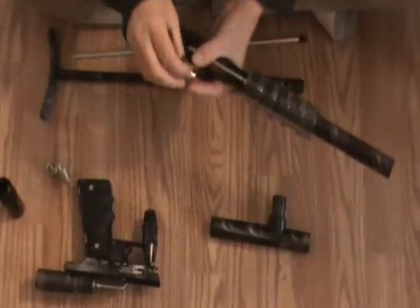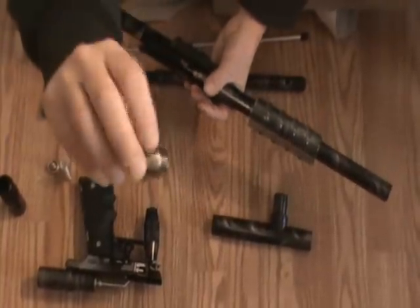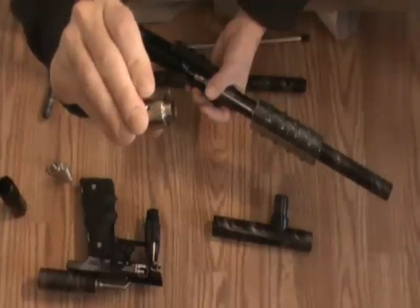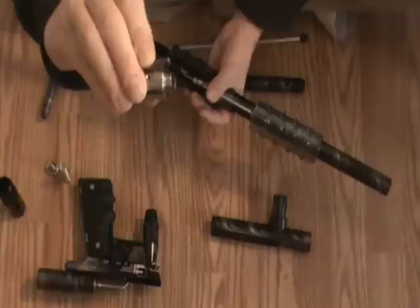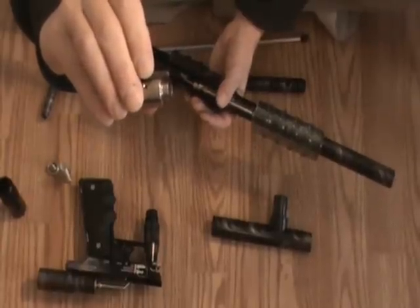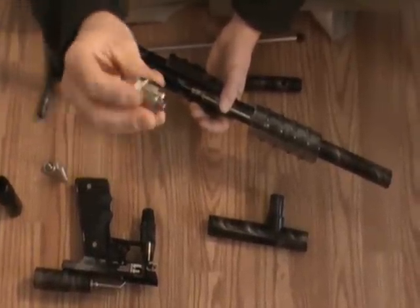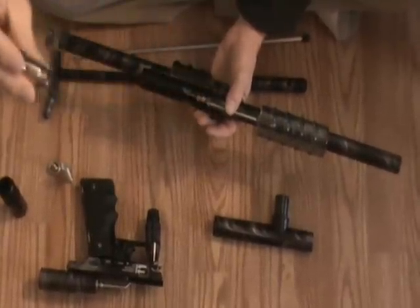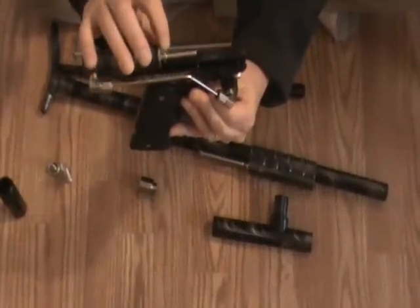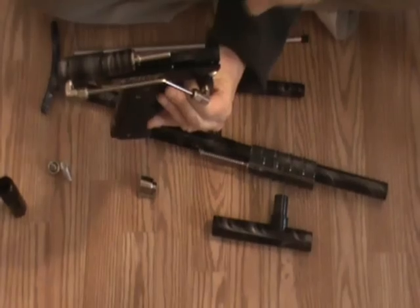The sear is fairly simple. It's got a spring underneath here that allows it to rock. That little forward portion that rises up there has a little hook on it that grabs hold of the lip of the bolt, so that when the gun is cocked, the spring is compressed between the bolt and the hammer. When you pull the trigger, it pushes on this little rear portion, raises the hook, releases the tube, and the bolt is able to fly back. It impacts this shoulder on the valve tube, which pushes the valve tube back, opens up the valve, and releases the gas to flow down the barrel.